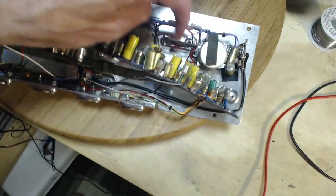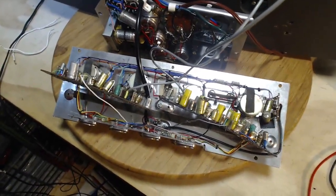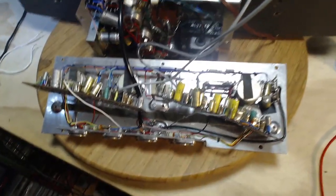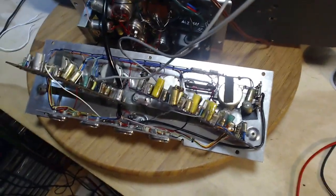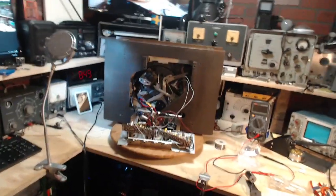These resistors are replacing the wire-wound resistor, which was really the cause of all the problems in this unit. It would appear that other than this, nothing was wrong with this player - fantastic! I was so convinced that most of the transistors were fried, and many guesses came in about dead capacitors and all kinds of stuff. Turns out it was a mechanical problem with a broken wire and a wire-wound resistor. Next stage is to put all this back into the player, put the front panel on, and get the whole thing ready for a test.